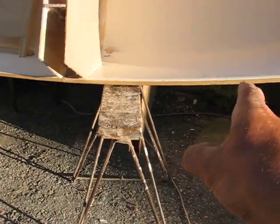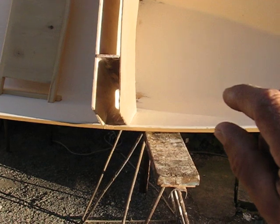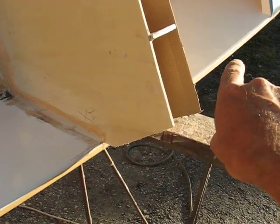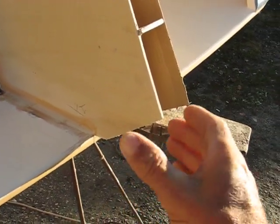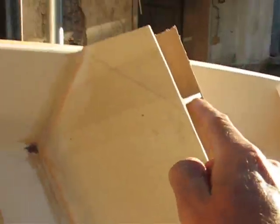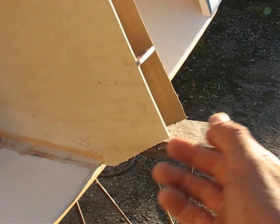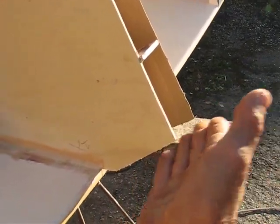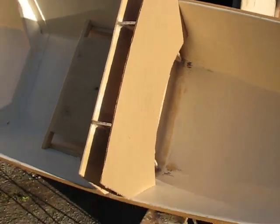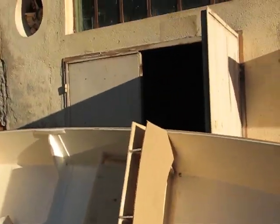The minute the new topside comes all along here, with a new shear clamp at the top — solid wood shear clamp — these guys will get notched out slightly and the shear clamp will be running through over here at the top of the plywood. Then this gets rigid too. The weight of the aka that's lashed down over here and over there is compressing on this rib, that rib, and these two bulkheads. That's going nowhere — it is so strong and it weighs almost nothing.